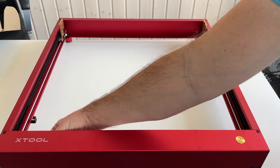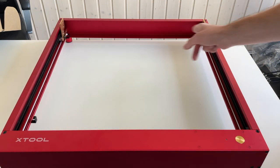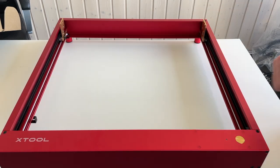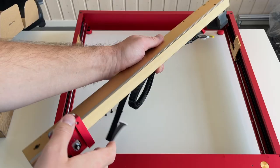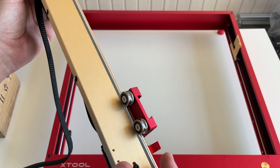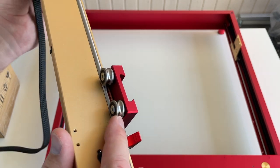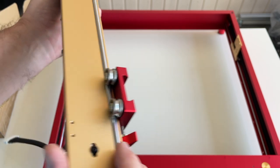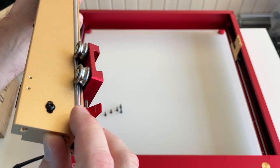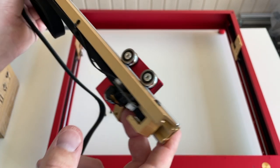Because over here we're going to install the X-axis. So right now if I move the axis, these two parts touch this rear face at the same time. It's hard to see on video, but believe me. This is the X-axis, and you can see how it works. On all axes they use this kind of bearing with a U-shape, and over here they have stainless steel precision rods.